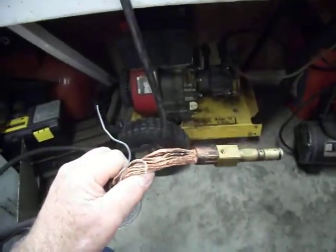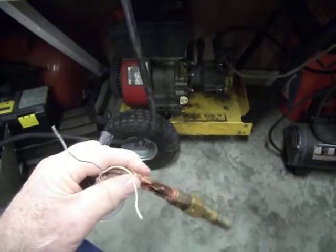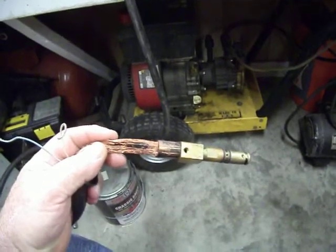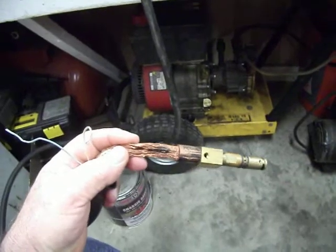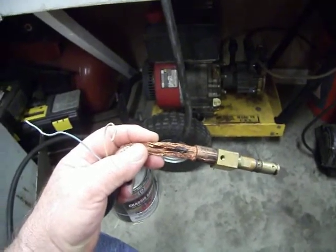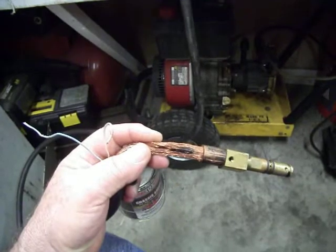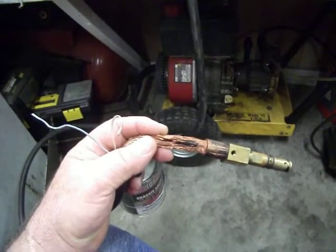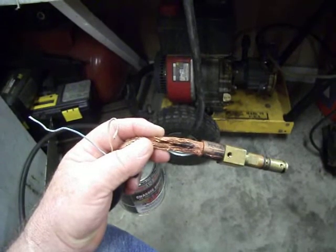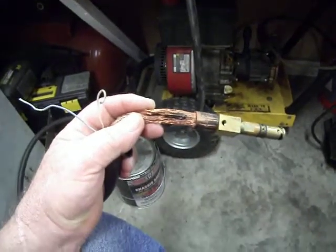As you can see, the copper wire here has gotten hot. This is what supplies the amperage from one end of the cable to the other, to the gun end. If this does not make good connection, your amperage will go through the liner and cause the wire inside the liner — the wire feed — to jam up. Usually what happens is the tip gets red hot, expands, and jams up the wire. So it just jams up and won't move, and I cannot weld more than about one inch. This happens every time.